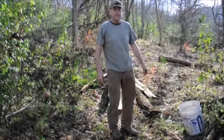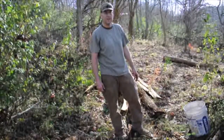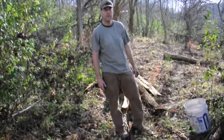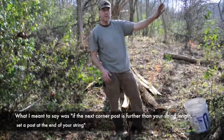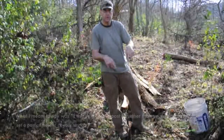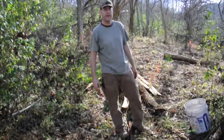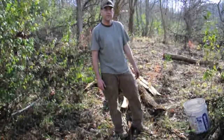I hope you enjoyed the splitting post portion of building and mending fences part one. We're going to do a video in the near future on setting posts in a line in a fence row — setting the corner post, then the next corner post, or if the fence is longer, going to the end of the string and setting a post, then drilling holes or digging fence post holes every 10 feet along that line. We'll record that video once we get these down to the field. We're going to be building some fence. Thanks for watching. Tune in to the Save Our Skills YouTube channel and check out our blog.